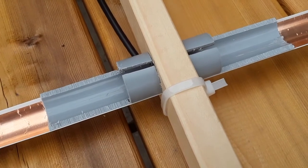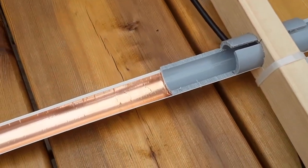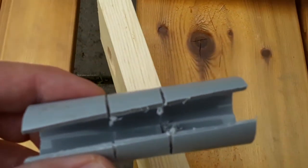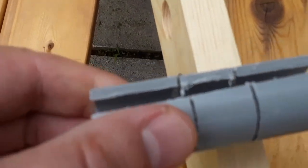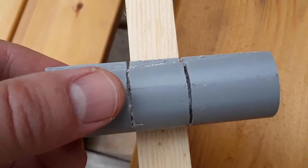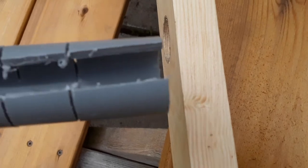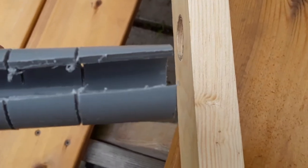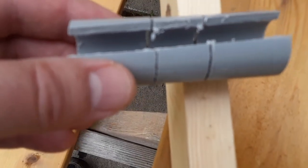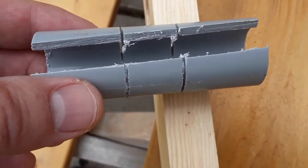The other idea is how these elements are held into the boom. I've used a ¾-inch PVC conduit, and I've cut a couple of slits — not completely through — that are about the same width as the boom. With a large slot across the top, you push these through a 1-inch hole. This conduit is slightly larger than 1 inch, so once it reaches that center section, the two outer portions expand and lock it into place, stopping any back-and-forth motion.